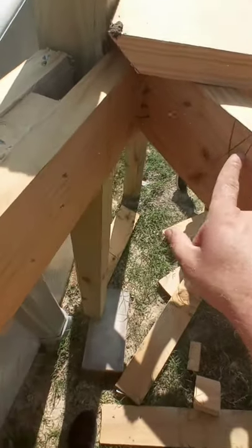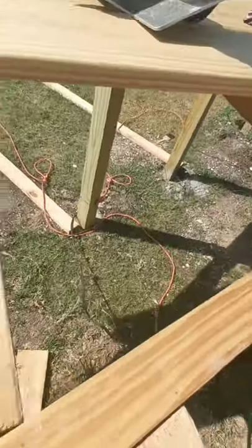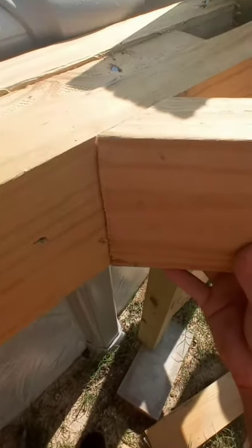Gauge it every single joist and shoot it or screw it — that's how you do it. We're cutting these angles the right way, unlike this guy who just runs all his boards square and doesn't even try to angle them. Look at this terrible craftsmanship — doesn't even attempt the angle. We cut one side at 45 degrees and one side on a 10-degree bevel. See how we did? That's how it's supposed to look — nice, perfect angles, tight fit.